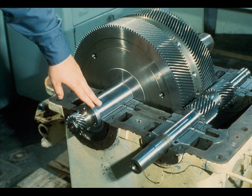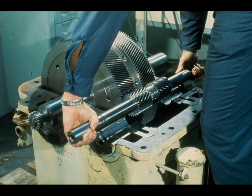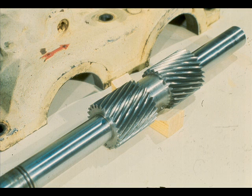With this one it's easy — the slow speed gear shaft extension must mate with the gear pump. Now, simultaneously rotating the shaft, lift the gear from its lower bearing halves. This must be done carefully to prevent damage to the gear teeth and lower bearings. This is a small pinion and may be manually handled; larger gears must be rigged and hoisted out. Set the pinion gear aside on a protective surface to protect the gear teeth, and block the gear to prevent it from rolling.